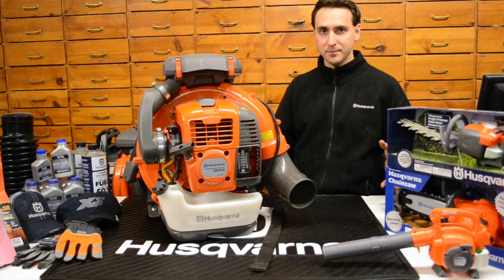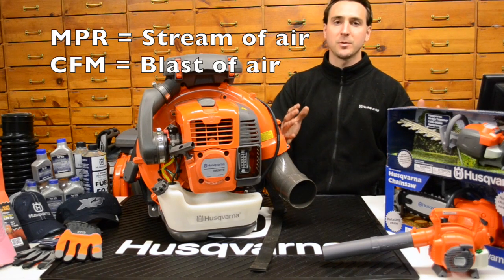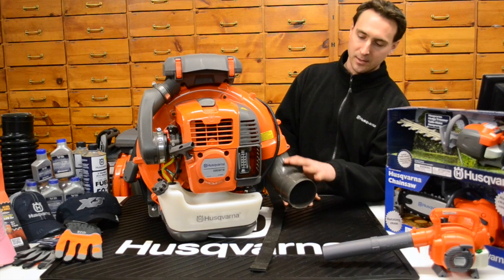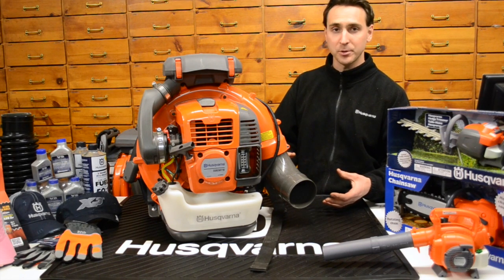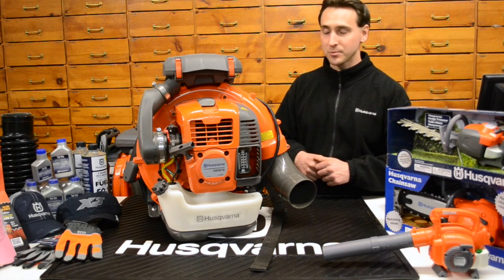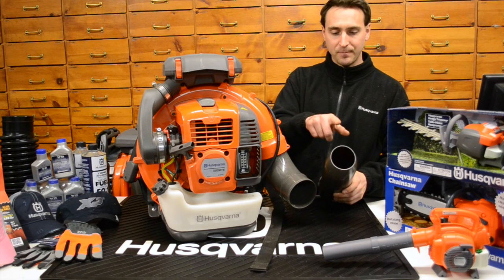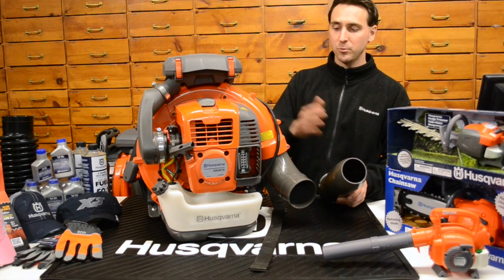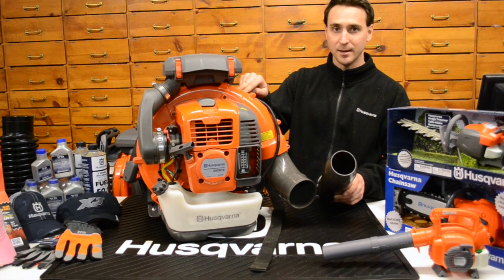If you've got a real large pile of leaves, what you want is volume. You don't want a little jet just shooting inside that pile — you want a giant massive airflow that comes right at it and hits it. The second stat you want to look for is CFM, cubic feet per minute. The more CFM a backpack blower pumps out, the happier you're going to be. For any construction or landscaping work, CFM is basically the number one stat to look for. Pay attention when comparing blowers: you can measure CFM at the nozzle tip and also inside the impeller housing. Make sure a good company gives you both measurements, but if they don't, they'll typically favor the higher impeller housing measurement. Miles per hour is typically just measured at the end of the blower tube, so you don't usually find two readings on that.